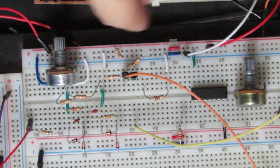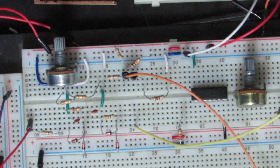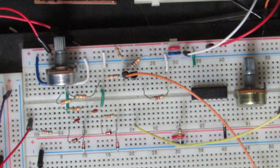Even 100k input impedance wouldn't be good enough. On top of that, the bias network parallels the input impedance — we've got this 100k input impedance in parallel with the bias network of 10k in parallel with 47k, which looks like about 8.5k. So that bias network dominates the input impedance. You're essentially trying to drive 8.5k from a 150k source — that's not going to happen, and that is why we're seeing this attenuation.